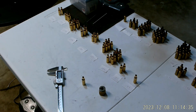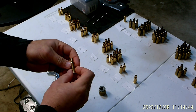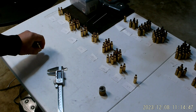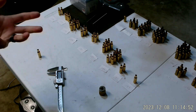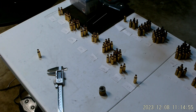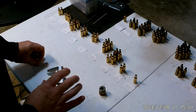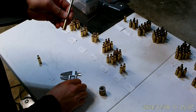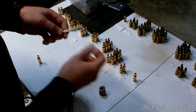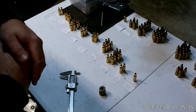For this particular test, it wasn't directly a test of precision or ballistics, although it's related because weight sorting brass and case head thickness interact in some way. Knowing how these variations relate to each other would be useful. So we went ahead and measured four things. We measured case head thickness using the simple rod and calipers technique — seemed practical and it didn't take long. I was able to do all these cases in less than five minutes.